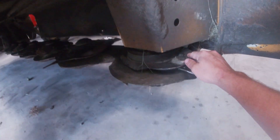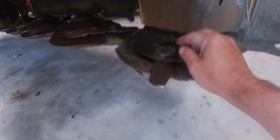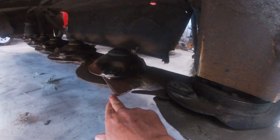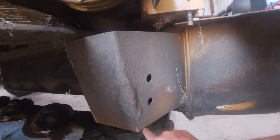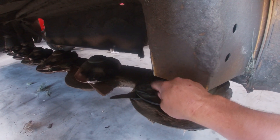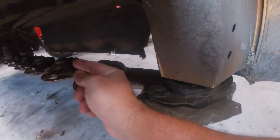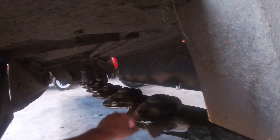Next up is this drive pod I need to rebuild. You can see this blade is all beat up - that's from making contact with this blade here. If they're positioned just right, they will actually hit. See how close they are? That will trash a full brand new blade. You can see how much slack and play I have in here. It's not from the gear shaft going through the gearbox - I've rebuilt that in a previous video. It's the gear inside here and the hex shaft that runs through all these. This main drive pod turns the first gear which turns the shaft running all these, and all are timed correctly except this one is clearly out of time.